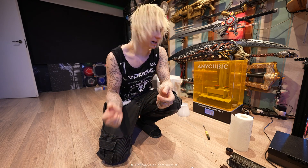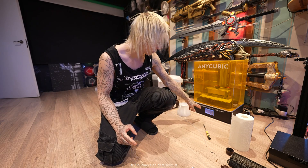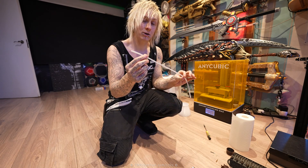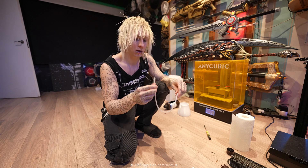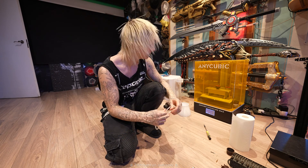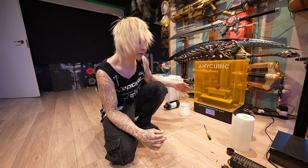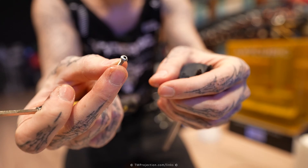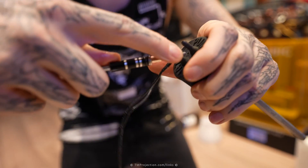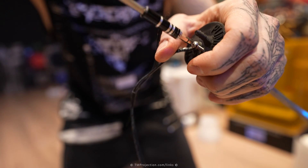To add on to my previous videos about the auto feeding system: if you have a large print on the way and want to make sure it's 100% functional, at the start of a print make sure auto feeding is enabled. Scroll down in the menu all the way down and set auto feed speed to 100%. Keep an eye on the clear tubes and wait for the resin to be pushed out. Once you see that it's working, turn the auto feed speed back to 20%, because although you want to fill the vat, you don't want it too full. It does have a sensor with two little pins that go into the vat, which passes current through the resin. If a current is passed, it detects that it's too full and stops filling. One thing you will need is slightly longer M3 screws — around 13mm — for checking if the resin is present or not.